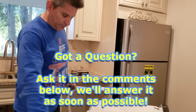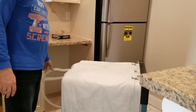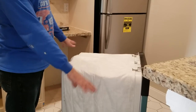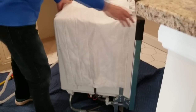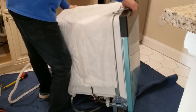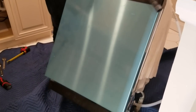What we're going to do is put down a big cloth here. I tend to do things a little different than what the instructions say — they want you to install the dishwasher and then lie on your stomach and reach in underneath to do the wiring. That's just crazy. So what I do is bring up the big carpet here, spin it around, and gently lower the dishwasher on its back. It's perfectly safe to do that.